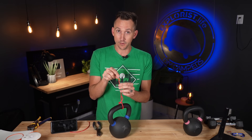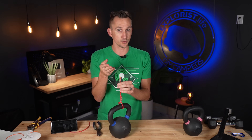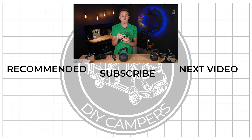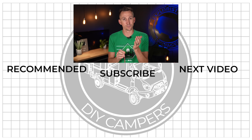These are the bigger lever nuts rated up to 30 amps. There's a smaller version rated up to 20 amps, but we're never going to ask any of these lever nuts to flow more than 20 amps because that would be disallowed per ABYC. That pretty much wraps up this video — if you want to see all the tutorials we made using these lever nuts for those small branch circuits, I've got a full playlist linked right down here.